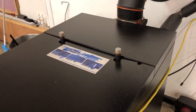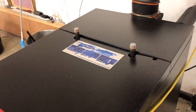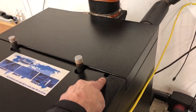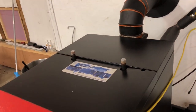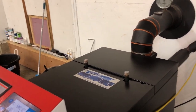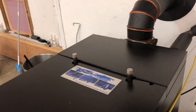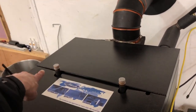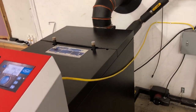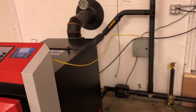The way it works is there's a Watts mechanical thermostatic valve you install. It has a thermostatic element that goes into the boiler jacket, basically right underneath this cover — I believe this opening right here is to bring that element out. You'd mount the valve on the wall and plumb it to domestic cold water, pressurized at typically 40 PSI. When that thermostatic element detects near-boiling temperatures, it opens the valve, running cold water through the loop. You then exit that cold water outside, into a sink, or into a drain.